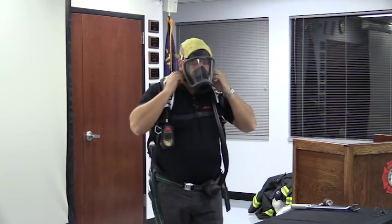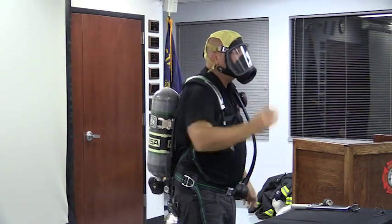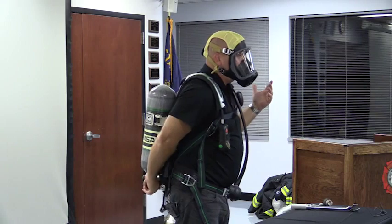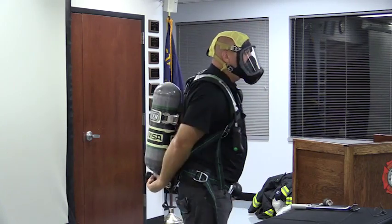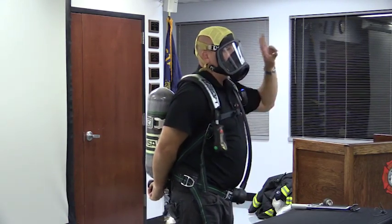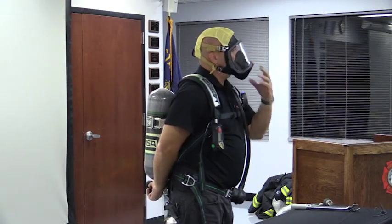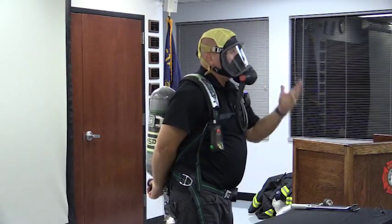Right here, have the ability, here again. Now I can check for a seal. Got a good seal, ready to go. When you're first starting, you guys have all put on SCBAs before, so you all know this, but I would highly encourage you, take your right hand, open up the cylinder valve, and leave your hand there, forcing you to use your left hand to connect the regulator. I want to take the regulator, bring it right up and connect it in. First breath, away we go.